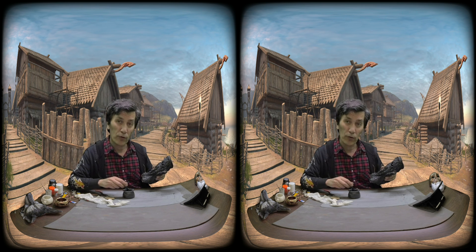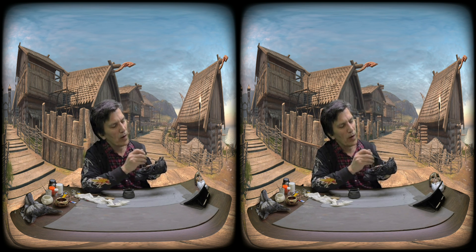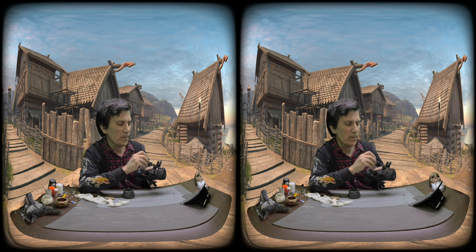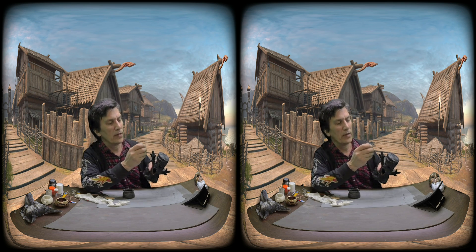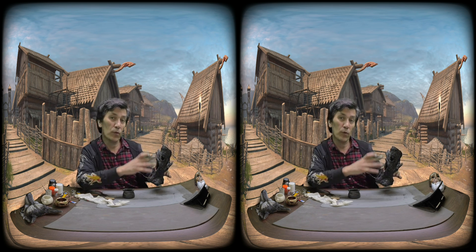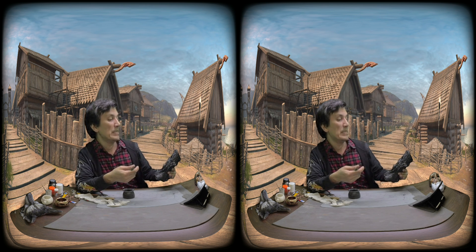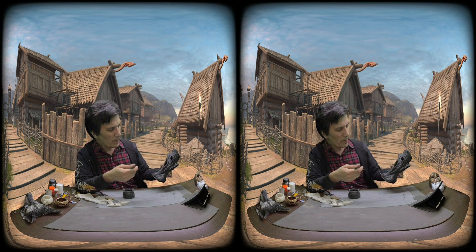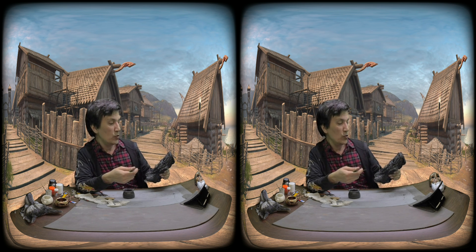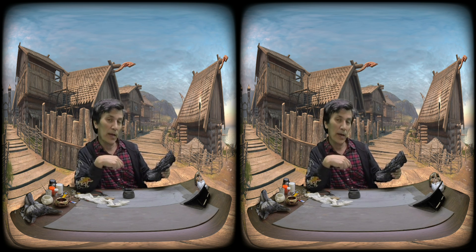Lower resistance the longer it cures. After we paint this, it's going to take about 24 hours, or at least the next day, until we stick it in the tank. Because we have multiple contact points, this will plate relatively quickly. Then we can turn on the full amp coverage — seven amps maybe — and then it's simply a matter of building up thickness. I'll proceed with painting these and get back to you shortly.